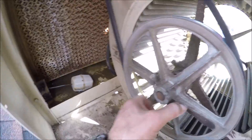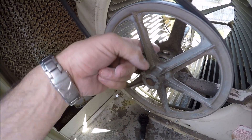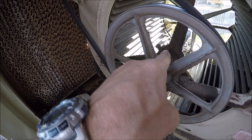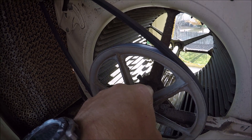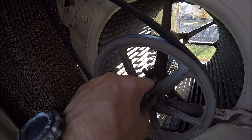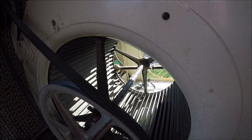One other thing for winterization and how one works: there's this little flapper here, and right in there you're supposed to squirt some oil in every year. I don't have any on me, so that's up to the new owners when they start this up in the springtime. Whoever they hire needs to squirt some oil into this bearing, and also the bushing and bearing on the other side.